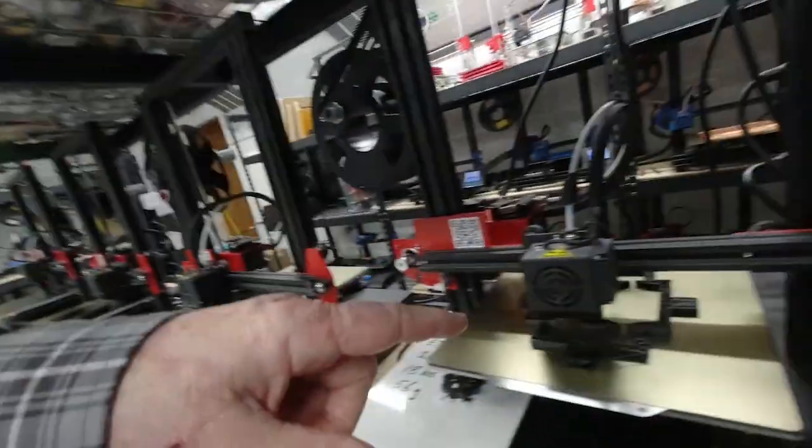I have to look at the way they print these parts, because some parts — like this particular part here — work better with a 0.4 because it has a lot of things that have to line up. The precision has to be good; there are parts that snap into place on it. I'm printing four or five of them at a time on this printer, and it prints five of them in 18 hours and 43 minutes. One printer can keep up; I've got a pretty good inventory, but I've been assembling more of them, so I'm printing a few more. I'll run it about nine batches without any problem — it's using 56 grams — and still have plenty of filament left over.